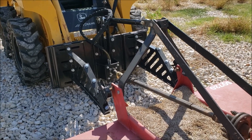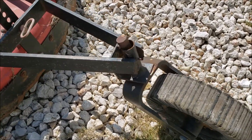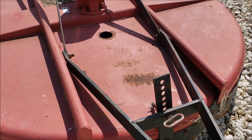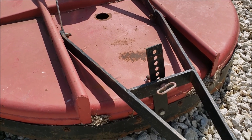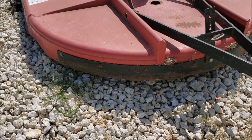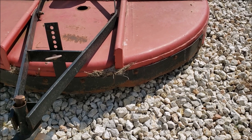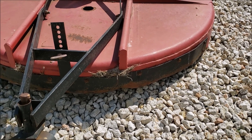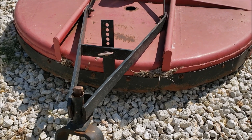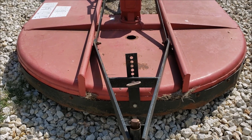I'm going to take off this wheel because it's just going to be in the way - it actually broke a weld anyway. I'm going to remove the wheel and all the metal infrastructure for it, and also take off this metal guard on the front to allow an opening as I come up to stuff. I know that will create more possibility of things flying out, but the hydraulic brush cutters you buy for the skid steer are wide open in the front, so I'm thinking I need to do the same on this one.